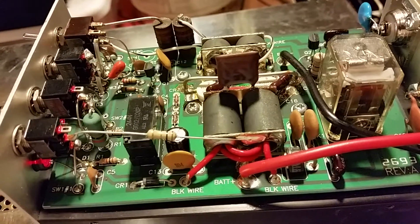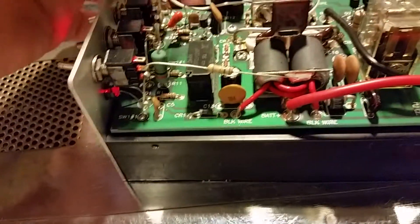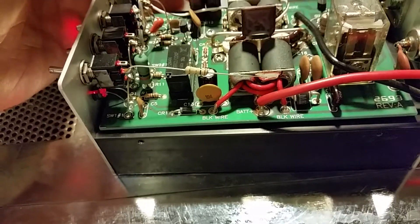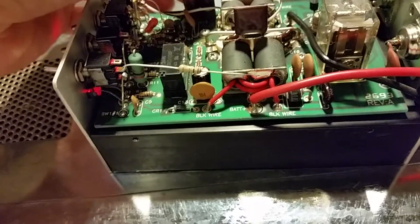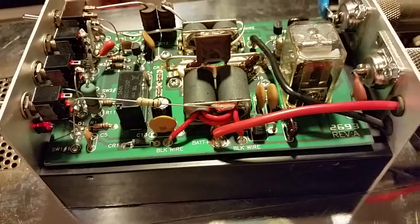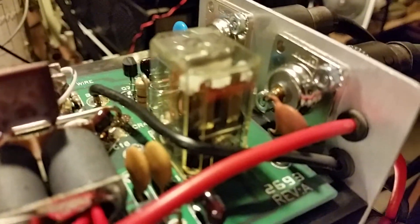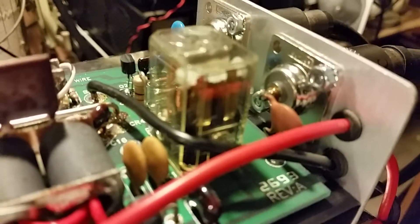There was only about half that resistance there already. I actually had these 222 resistors laying around from another amplifier where I had redone the high/low/medium circuit — so I knew I'd be able to put them to use one day. She's back up in operation. You've got a slight delay on AM, and she'll work just fine for you on sideband.